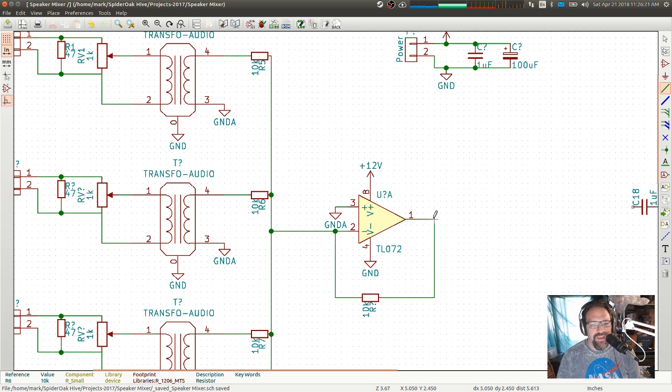And so the op-amp, through the magic of op-amps, drives this to a negative 10 volts for that to be the case. If it weren't at negative 10 volts, then the voltage on this node would not be our ground level. The voltage on this node would be something else, and that would create a voltage differential between the two inputs, and the op-amp would adjust the output to try and make those two inputs exactly the same.